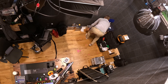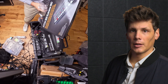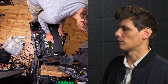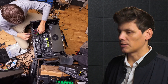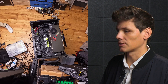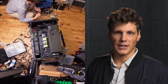Let's swing over to the computer and we'll take a look at a time lapse of how this was put together. This is the studio — my desk is on wheels, so it's very easy to reconfigure. Unboxing the ATEM 2ME Constellation HD to get a sense of size and how it sits within the rack. We've got the power conditioner coming into the side of the rack to make sure we have clean power. Because the Constellation HD is pure SDI, there's going to be times when I need to get HDMI in and out of the rack, so I have three bi-directional converters embedded within the rack.